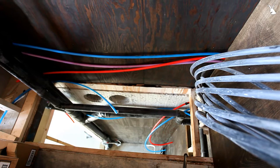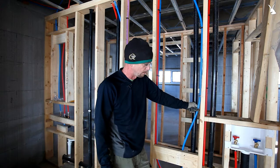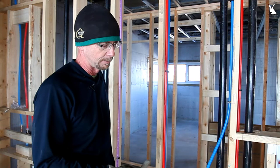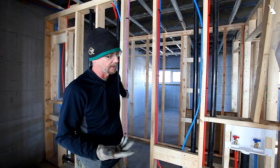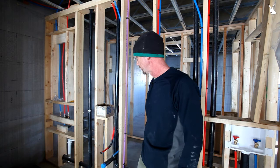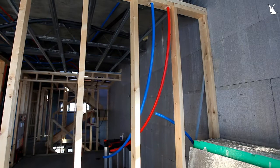We have a lot of water lines in different colors — it's pretty simple, just a color code. Red is for hot, supplying hot water for all your sinks, laundry, etc. Cold water is blue. Black is ABS for the actual drain, waste, and venting. The interesting one is the purple line — purple is for toilets and hose bibs going outside. The main reason is that we can run rainwater through those lines since we don't want it attached to any potable water sources, essentially just for safety reasons. You can sort of judge a plumber's work by how neat they are and how logical the layout.